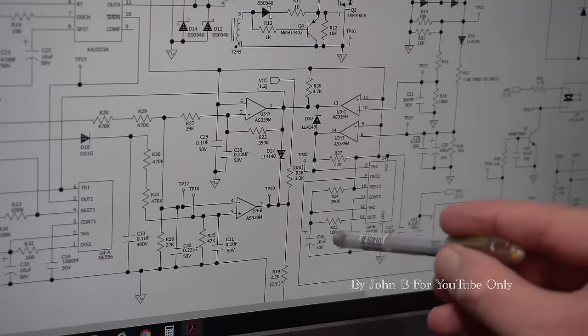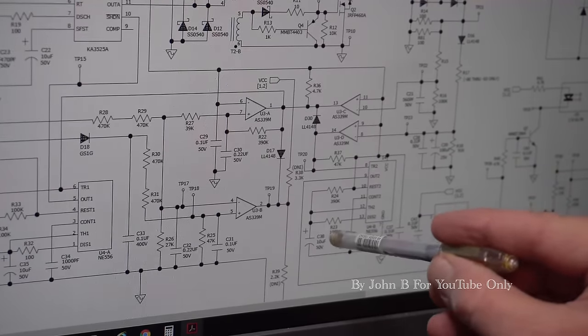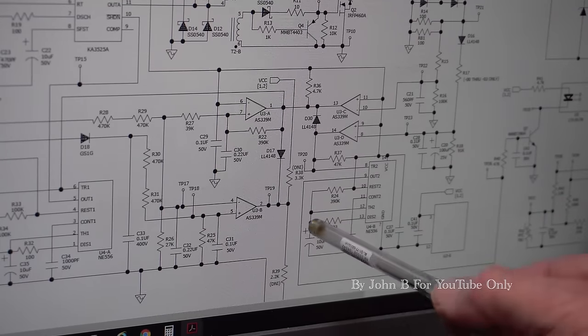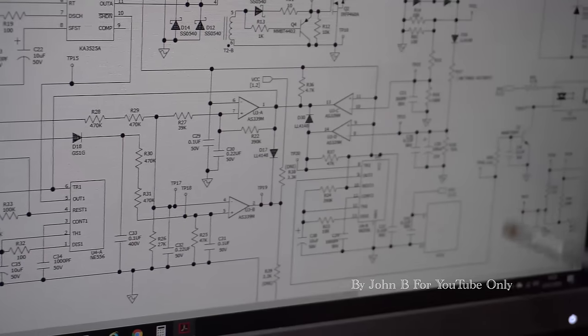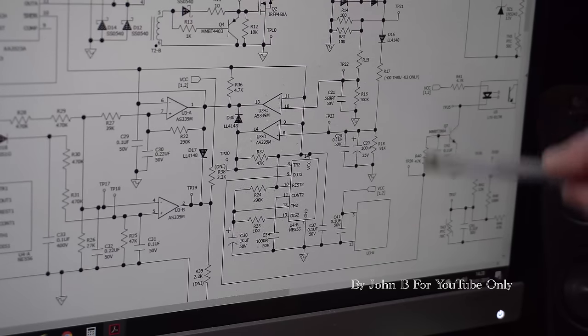So I thought, right, let me disconnect this discharge resistor, 100 ohm resistor, disconnected that, and the capacitor came up. So the capacitor came up, that should have reset that, and the output should have gone off, but I still had an output. So I came over to this transistor. I thought, well, that had actually been touched. So this is that 100 ohm capacitor discharge for the 555, and that's that transistor.